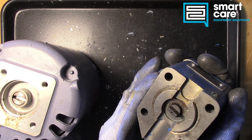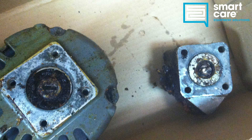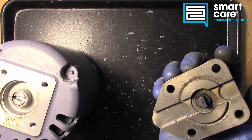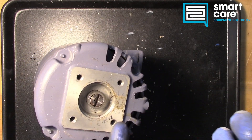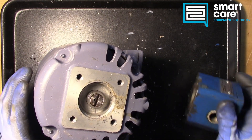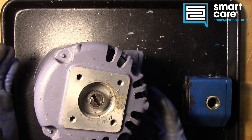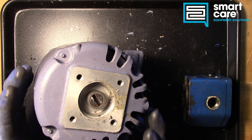I'll put the picture in here that shows you what that failure looks like. You can see in the picture the inlet of the motor is totally filled with oil, and the windings themselves have oil in them as well that's then hardened. So in current production, they've added this slot so that if the seal fails, the oil runs down the face of the motor instead of actually coming into the motor itself. You can see on our example motor here that this seal had started to fail — the oil ran down towards the bottom of the motor. In this case the motor still spins freely. I did power this motor up, it does run, so I'm not sure why the motor itself was replaced. In all likelihood, it didn't need to be.